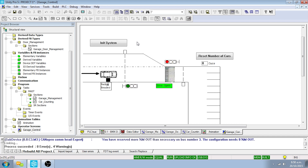The car is now able to enter the garage. Switch on the car entry sensor input by moving the channel one switch to the right to simulate the car having reached the entry to the garage. Move the channel one switch to the center position to simulate the car having moved past the entry point. Switch on the car exit sensor by moving the channel two toggle switch to the right to simulate the car moving past the garage door. The door will now close after 10 seconds and the number of cars counter changes to one. Move the channel two toggle switch to the center to simulate the car parking in an empty space. Repeat the last three steps to simulate additional cars entering the garage and note the car counter incrementing each time.